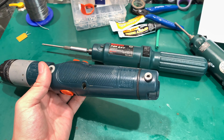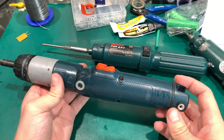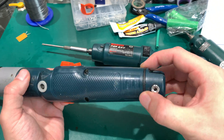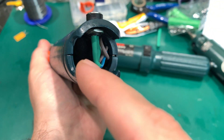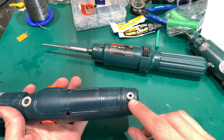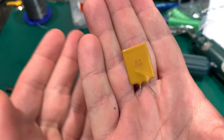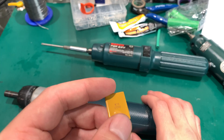The fix was putting a lithium-ion cell inside, because 3.6 volts is exactly what this device uses. I unscrewed it, removed the plastic element holding it together, stuck a cell inside, drilled a hole, and added a charging socket. In between the drill and the charging socket I added a polyfuse — I believe I used a five or six amp rating, which will be enough.